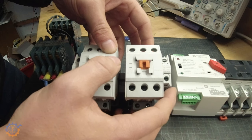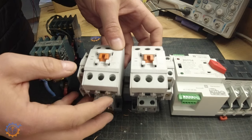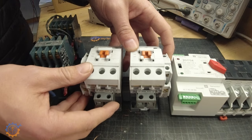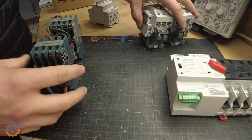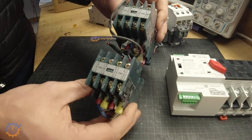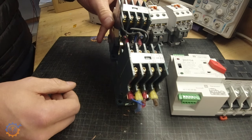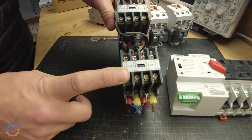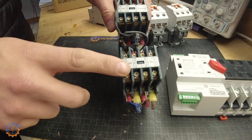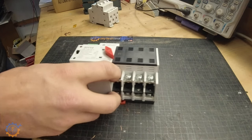As long as you have the side port, you can hook it up as an automatic transfer switch. I do recommend having a timer attached to it though, since this type always draws power. You can also use contactors of this type, except they don't have mechanical interlocking functionality. But potentially this contactor can be used as an automatic transfer switch — this one was actually taken from a UPS system where it switched between mains and battery power. But today is all about this one here.